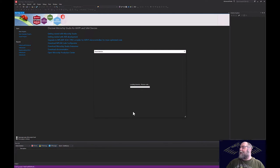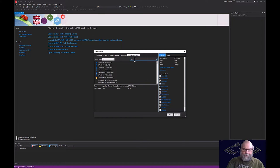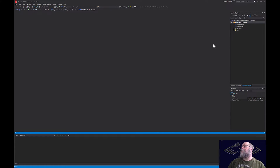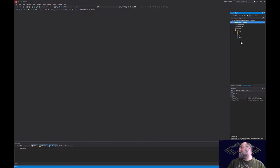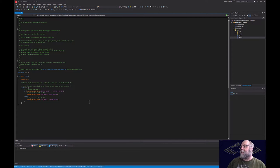Hit OK to bring up the board selection. Select by board and filter by SAM4E — our SAM4E Xplained Pro appears at the bottom. Hit OK and here we have our project created. Opening main.c shows the template, which does basically the same thing we're going to do in our FreeRTOS version: if you press the button it turns on the LED.